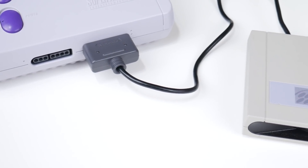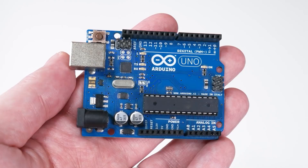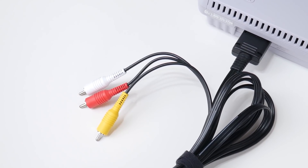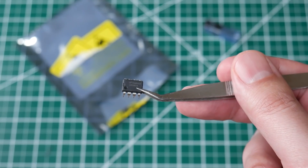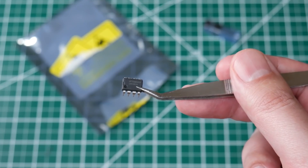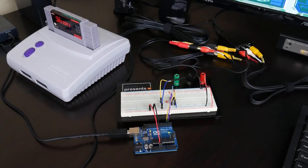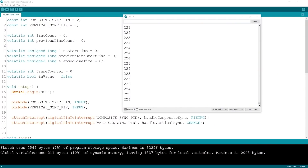Now I want to shift focus to the receiver. This infrared receiver gets data from the SuperScope and sends signals to the SNES through the controller port. Our newly designed receiver will be powered by an Arduino, and one of its jobs will be to process composite video coming from the console. We don't actually care about the video itself — only the horizontal and vertical sync, which will allow us to communicate with the SNES in a properly timed manner. The Arduino isn't fast enough to handle this directly, so we're going to use an LM1881 sync separator chip. Building the example circuit from the datasheet and running Arduino code to count lines in a single frame, we get results very close to the SNES resolution of 256x224. I'd call that a success.